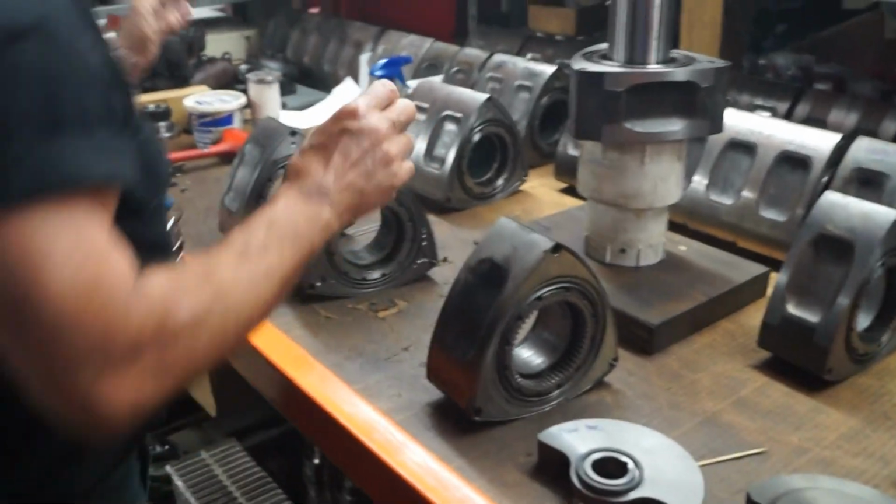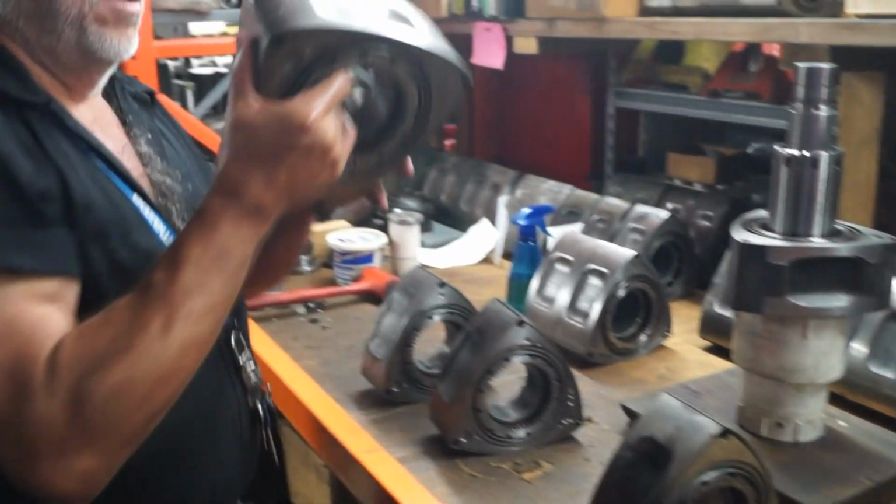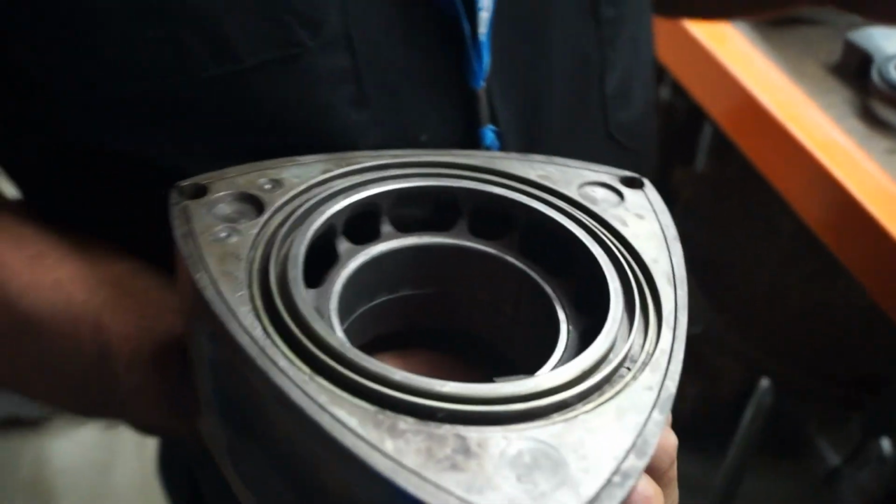Take any year of previous rotor from Mazda, from the factory, they come balanced. To what degree? What they consider acceptable, somewhere around 5 grams. Maybe 3.5, maybe 7.5, but somewhere in the middle of 5 grams is acceptable for a production engine. From the factory, they get it to a level that is acceptable for a street car, and they go. They're automated.